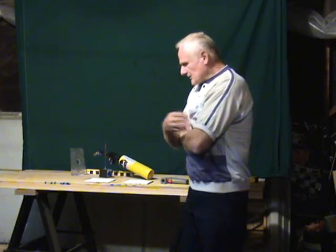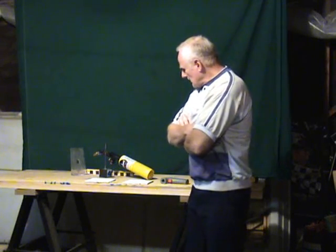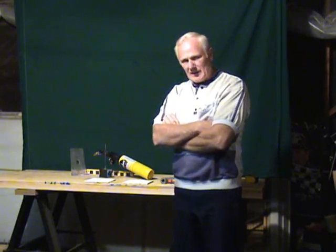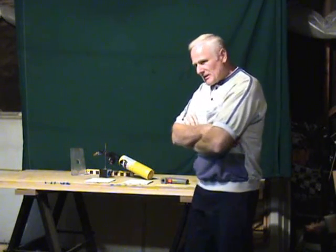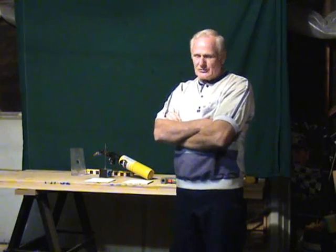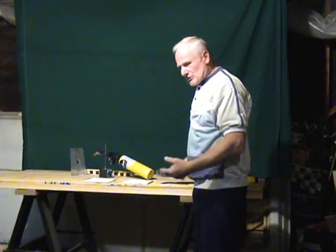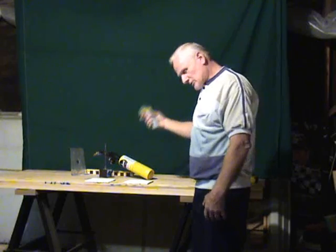So we're going to take the first sample, which is the radiant barrier with the exterior base, and we're going to set it up in a stand, and we're going to impinge the center of this flame on this radiant barrier with the exterior base. And then in the second part of the test, we'll use the second exterior base only with the compound 2 flame out, and that's my compound that I've invented. So I'd like to set up the test. We'll first start by checking the ambient temperature of the sample, and then we'll set the sample up.